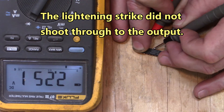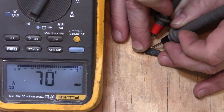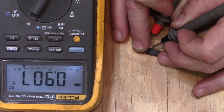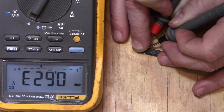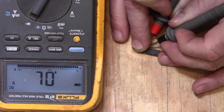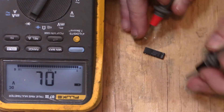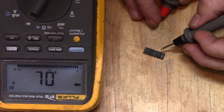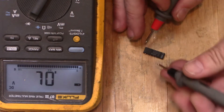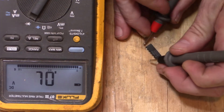There's pin 4 — that's not bad: 2.244, not shorted. Pin 5: 0.906. Pin 6, the output — not bad: 0.623. So we have one shorted line receiver. The second looked okay.